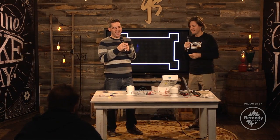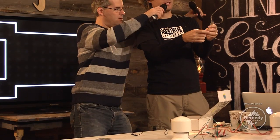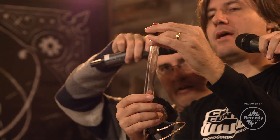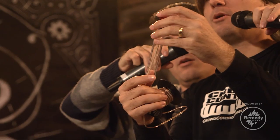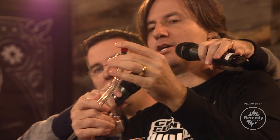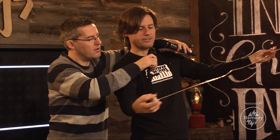You don't want a toggle switch either — where you press it and it clicks on, press again and it goes off. You want a momentary switch: press it and it's on, release and it's off. So you got the tubing, run the copper wire through it, put the momentary switch on the end — you can either twist-tie it or solder it on. When you push the end cap down into the tube, it's not glued — it's just friction that holds it in place.